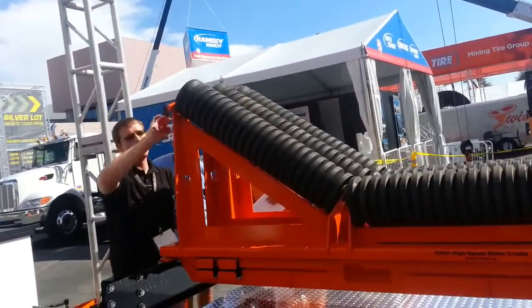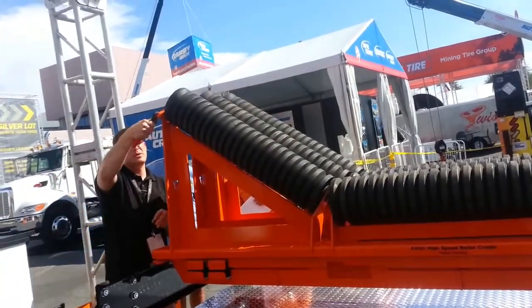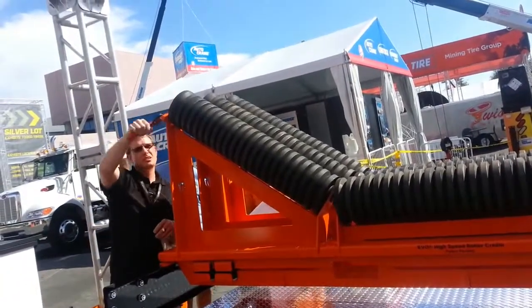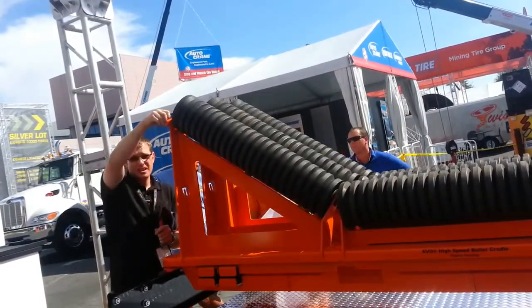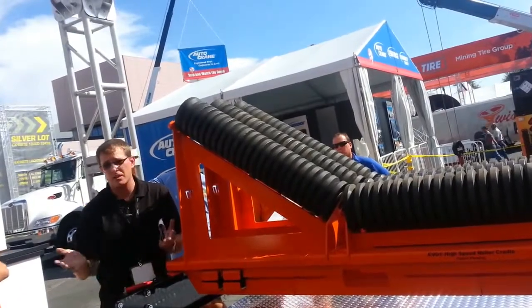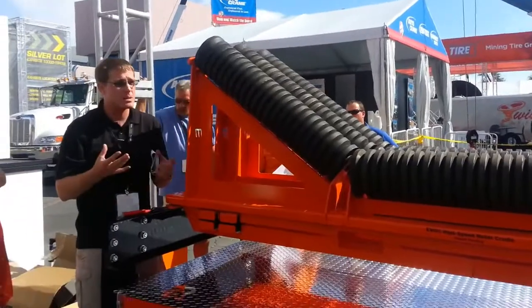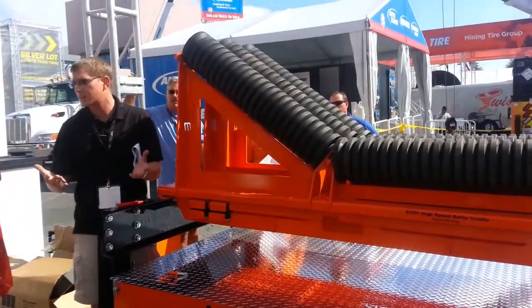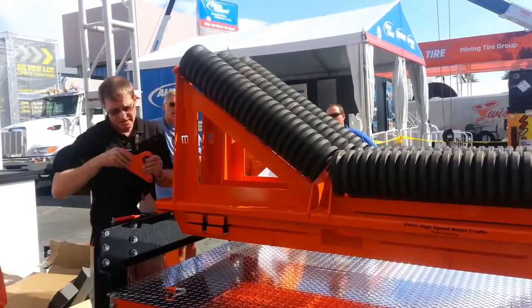We also have the whole unit riding on these bars. Why do we use impact bars? Because we have an idea about how they deflect, how long they're going to last, and they're readily available to anybody around the globe. This could end up being something different — maybe we pour it out of urethane or find some other material that's a better shock absorber. But for right now, we're using the bars and they're working very well.